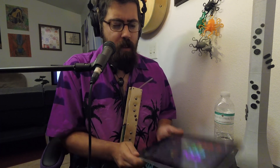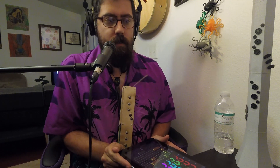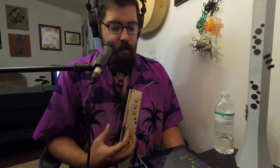This is all done from my iPad wirelessly. What it's doing is taking the synthesizer data in the form of the sliders and all that, putting it in OSC messages. These OSC messages are going back to the Raspberry Pi, which is running the MIDI of the instrument and controlling the synthesizer that you're hearing. This synthesizer will be onboard the microcontroller, which means you don't have to have the Raspberry Pi.